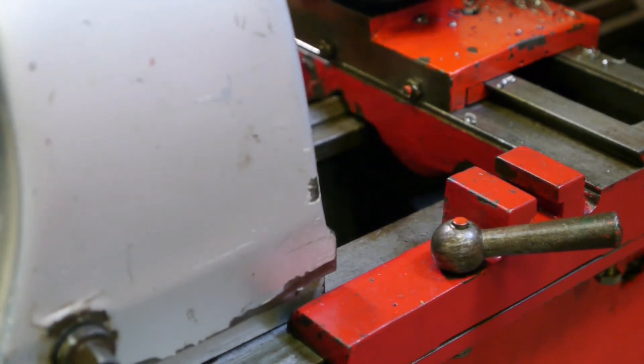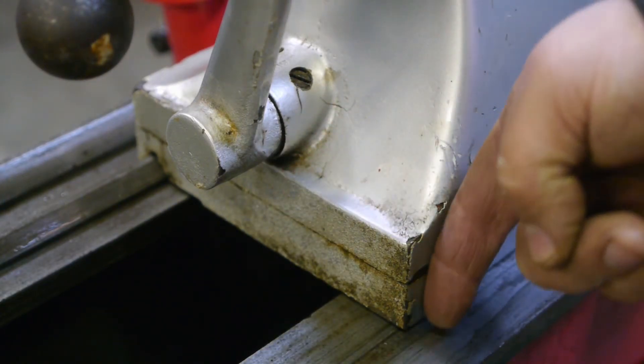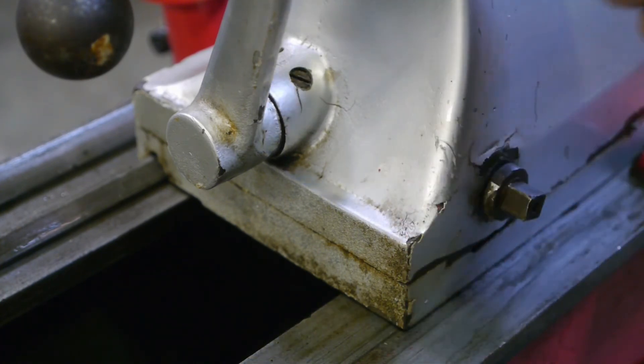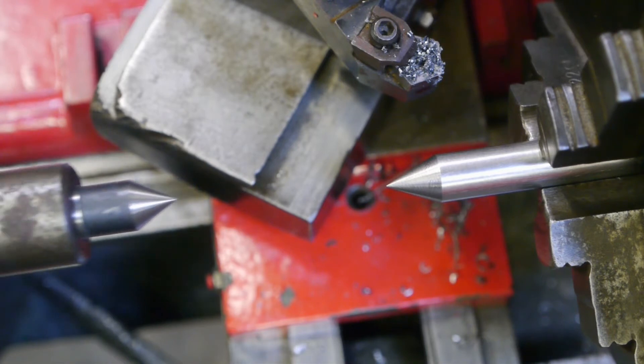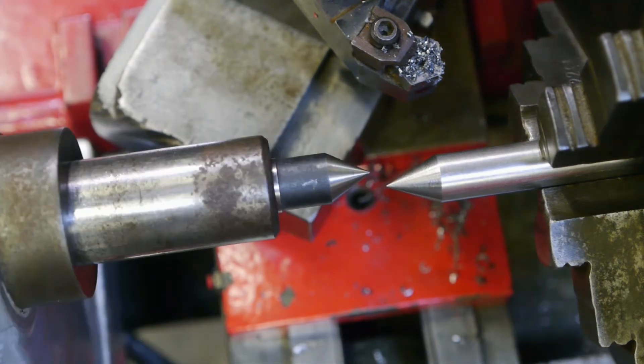So I turned it back. Now there's no indicator here, so I'm assuming that this is the default setting where the base and the tailstock are nicely aligned. Well, that's not even close. My first thought was more tailstock problems, but clearly the tailstock offset was to compensate for misalignment issues, and I think the problem is in the mounting of the headstock.